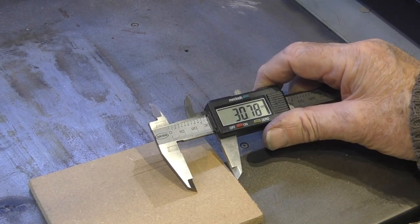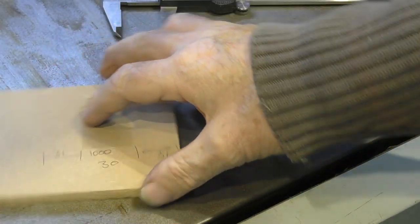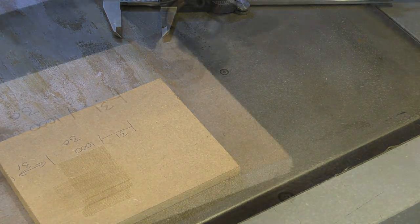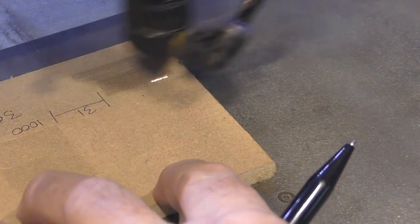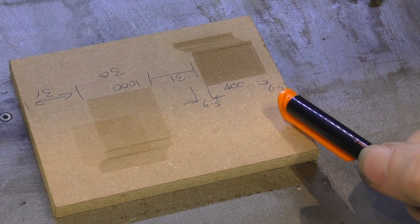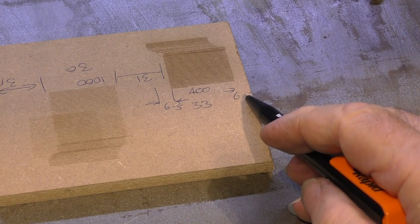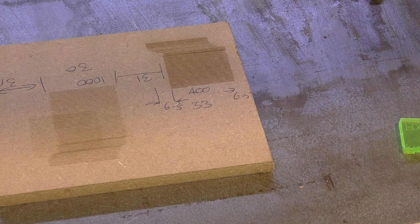So we might be running twice as fast, but we've pushed the overrun now to 31 millimetres. I think an optimum speed may well be something like about 400, where we should probably get below 10 millimetres of overrun on a 30 millimetre programme. Let's just try that. So there we are, now at 400 millimetres a second. We've got our 33. So the point now is, look, we've got 13 millimetres of overrun and 33 millimetres of scanning. Significant gain in cycle time.